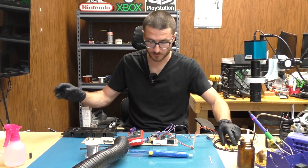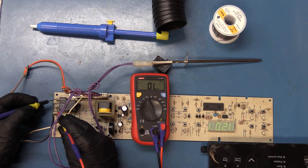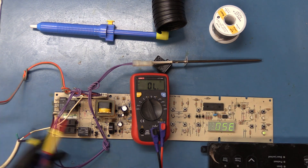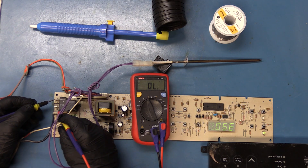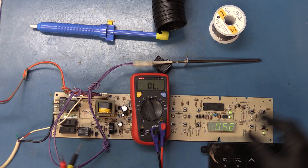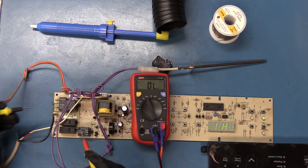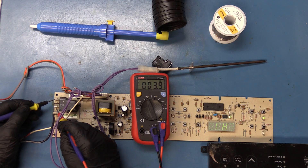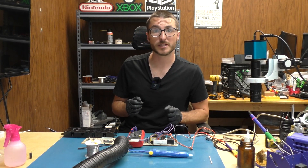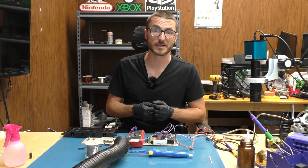We're going to do a quick check with our multimeter in continuity mode — so when we have a short, we get a beep. We have our L2 out and L2 in — we have no beep. That is what this relay activates: those two pins. Let's go to bake, turn that on, and wait for that relay click. We get the click and we get our beep — so that means our relay that we just installed and replaced is fully functional. Does our broil function also do anything for us here? We get our click and sure enough our relay is activated. This does confirm we have another successful repair. If you have an oven controller board you'd like to send in for us to fix, we'll have our contact information and website in the video description down below. If you found the content helpful, make sure to leave us a like, subscribe for more, and thank you for watching.